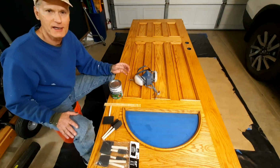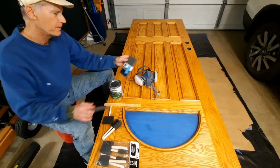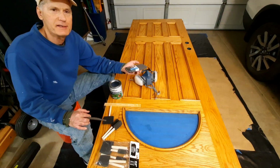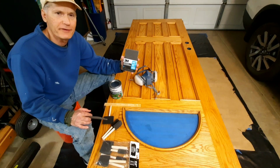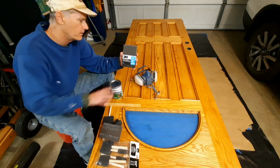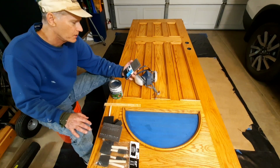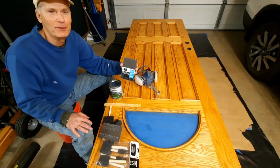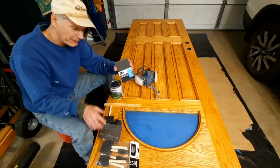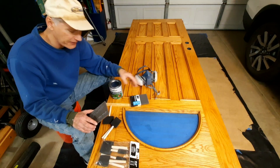So we're going to be using a sanding pad. This is the 3M ultrafine hand sanding pad between coats. That way we'll take off any imperfections, you know, run your fingers over the surface and see where it's at. So this, it says, removes bubbles, nibs, and other blemishes. I'd prefer to use these than actual sandpaper, but we'll see where we're at and how effective it is.